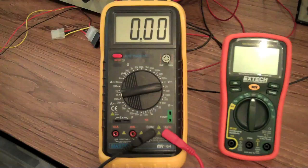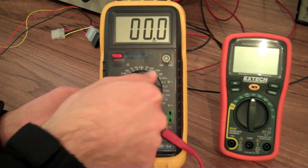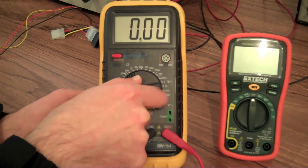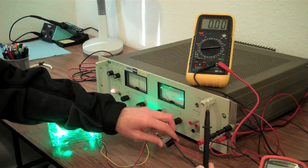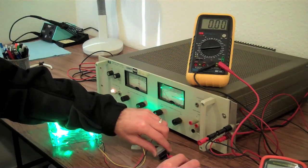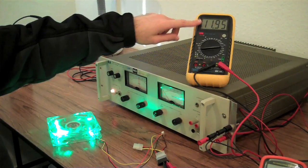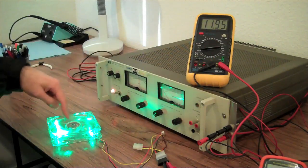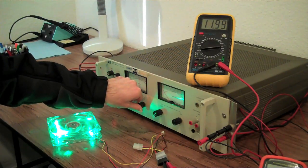So we'll turn it to the 20 volt scale and turn the multimeter on. The order doesn't matter — you can adjust the scale while the multimeter is on. As you can see, the decimal point just jumped over a space. If you go to the kilovolt range, the decimal point goes away because that becomes your entire range. We'll take our negative lead, color coded black, and insert it into the back of the connector — this is essentially our ground lead. Then we'll take our positive lead and put it into the positive side of the connector. Once the probes are inserted, we get a voltage reading. We can see it's reading 11.95 volts — let's adjust that up to 12 volts. There we go, 12 volts. So now the fan is receiving 12 volts and you can verify that with your multimeter.